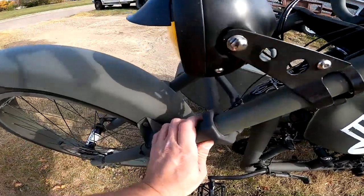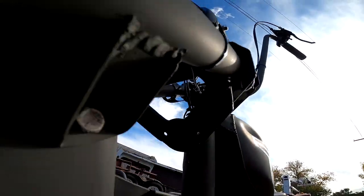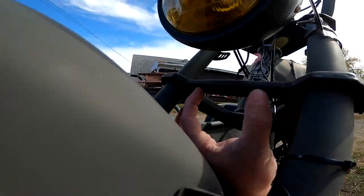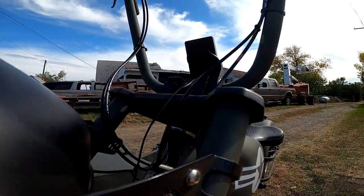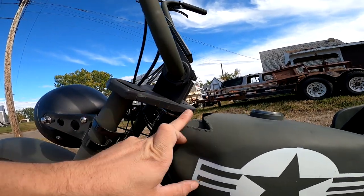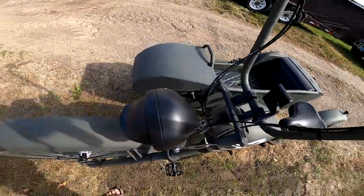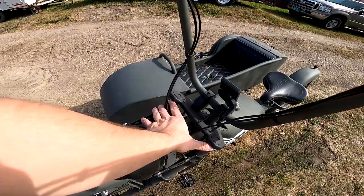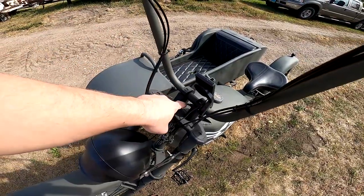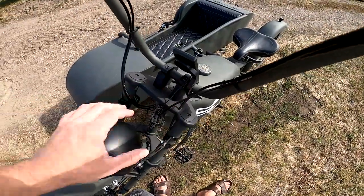And then I used the original forks, the original fork tubes, for the triple tree. I beefed them up and welded them together. You can maybe make out the cut lines. I welded an extra that much there, there, and this in here. Did the same thing for the top, and that way I could widen it up. You can see my plate here that beefs up the joint. That's how much I welded in there. So that widened it up so I could fit this tire. Look at that, that is way wider than the original. These holes were the original holes for these. I used the rear original holes back there on the rear plate and drilled new forward ones, but that gives you an idea of how much I had to move these to widen them out.